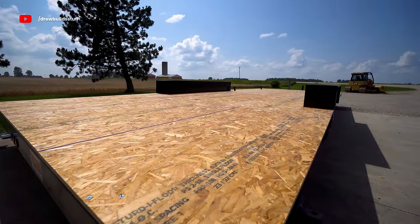To be honest though, the steel's pretty flimsy and I think the plywood would offer more lateral support as long as it's nailed properly, but for the price this costs, better safe than sorry, I guess. But here's a good clip of how much a stud moves that's supported at 2 points, and one that's not supported at all.